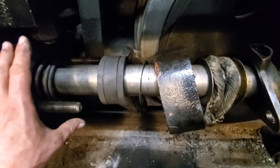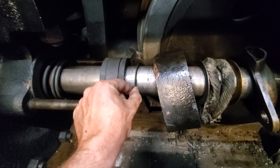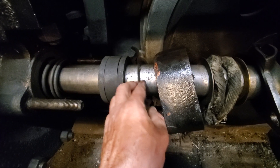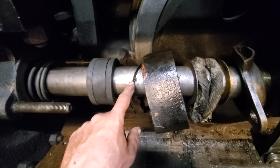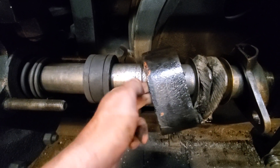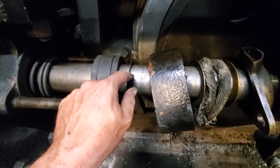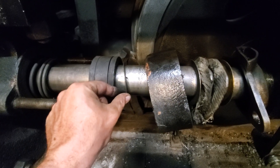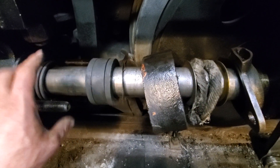I put this back together the way that J&L had it. But when I tore this apart to look at it, I thought, I wonder if this little ring here — and it's not ground, it's not flat, it's just a piece of brass stock that they made and put in here — I wonder if this is the cause of the problem. Because instead of this ground surface touching the back of the ground surface in the cup, you've got this little thing in the way. I just have this feeling that steam is coming around, passing between this surface and that surface because of this and getting out. So I'm going to cut this out and get rid of it, and put this all back together, and the next time we fire up, see if it makes a difference.